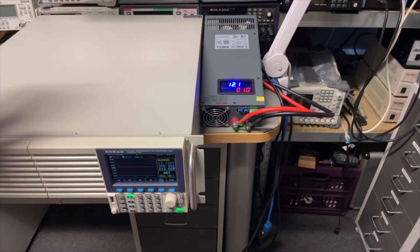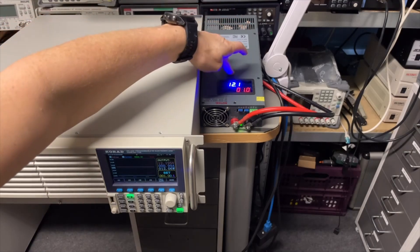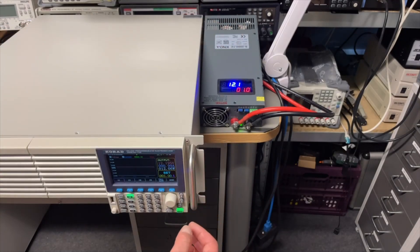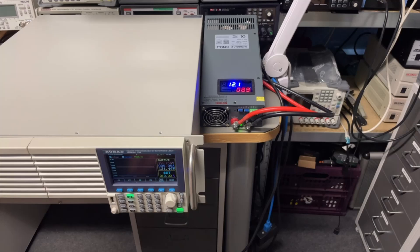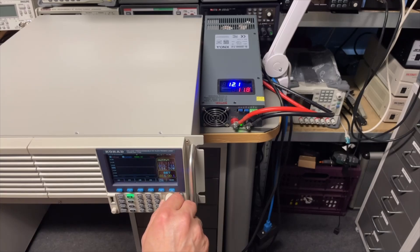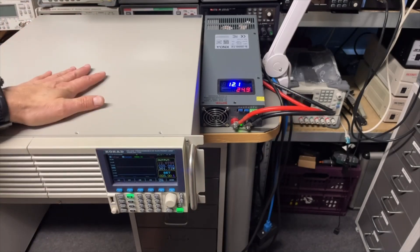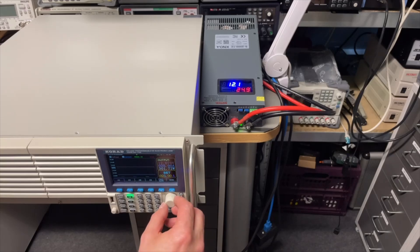The fan control should be a lot better with this platform. Let's just turn up the current to 10 amps — usually quite a lot — and it doesn't get nervous at all; neither device makes any noise. Let's go to 25 amps. That's usually a lot too, but it's only 300 watts, so it's not nervous at all. My cables are not warm and none of them make any noise. That's a huge difference because on the older series the fan was just on or off — this one they improved a lot.